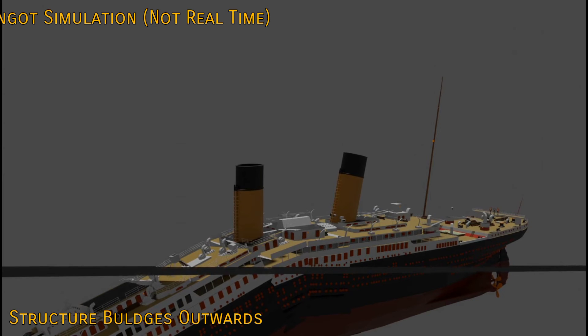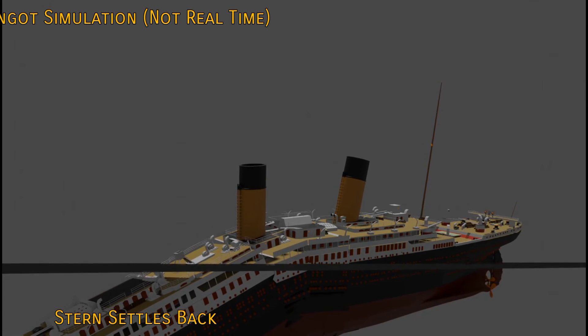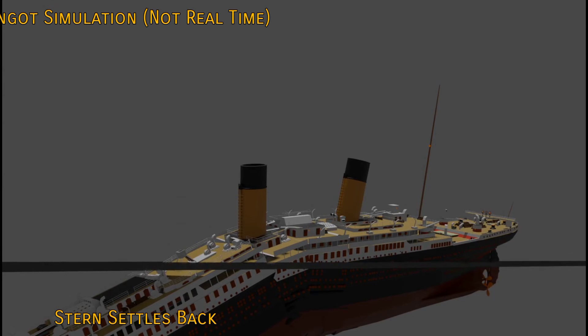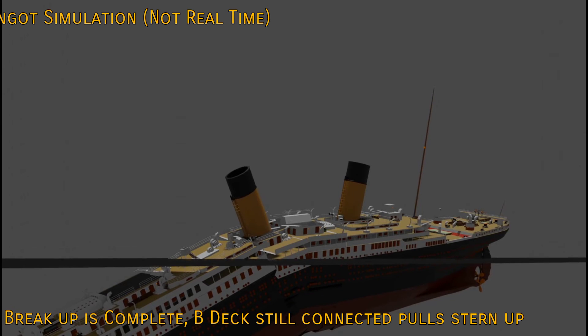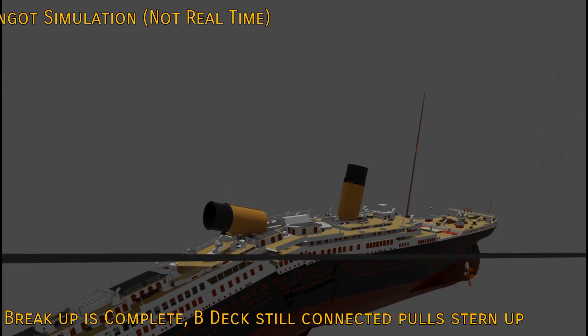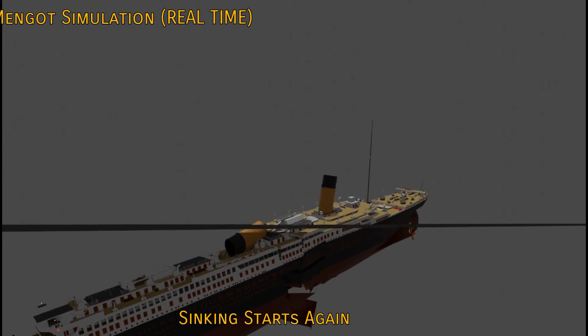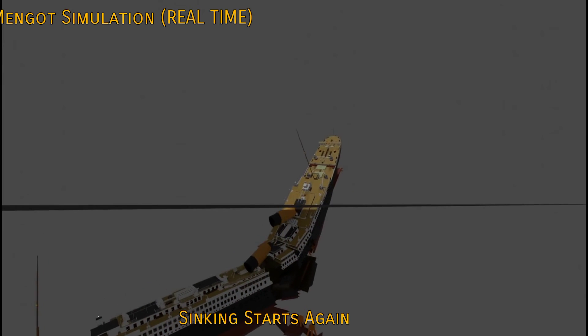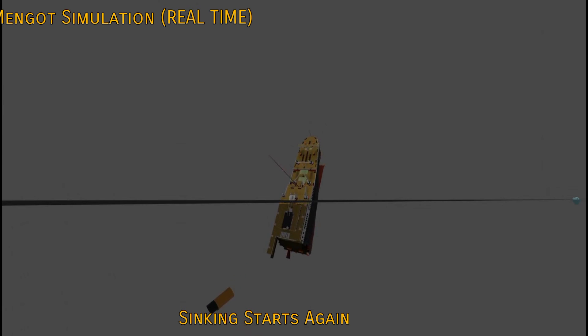Ultimately, the shell plate has to tear into pieces from the bottom up. At this point, the shell plate has separated over a wide area of the stern so that large sections fall off and the entire front half of the stern floods rapidly and sinks minutes later. It is also probable that the port and starboard sides broke at slightly different times. This asymmetric breaking of sides would cause the differences in how the stern appears today. Since the ship was listing slightly to port, the stern might have a tendency to rotate slightly to starboard, while the bow, powered only by gravity, tends to move slightly to port. This would set up a twisting motion in any remaining whole section plates still connected.